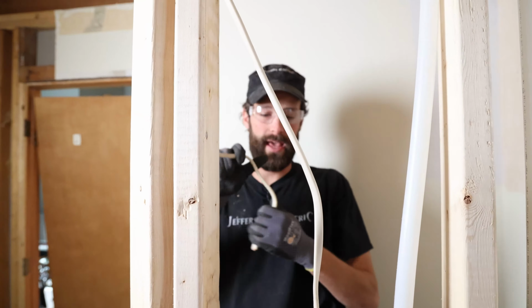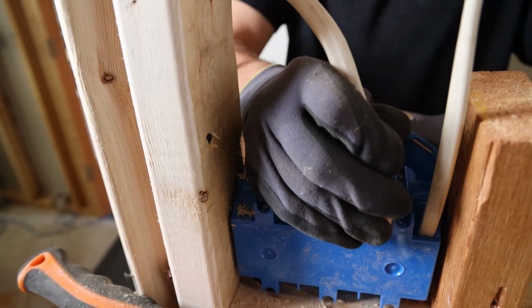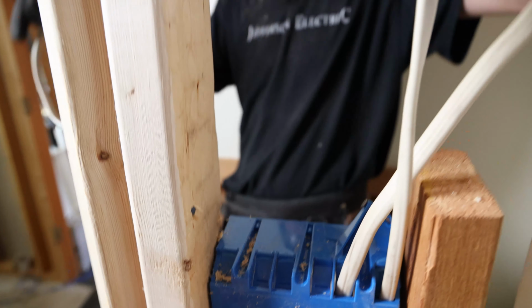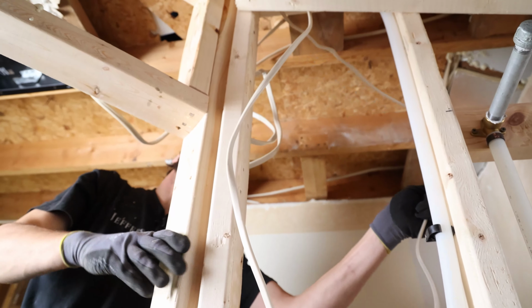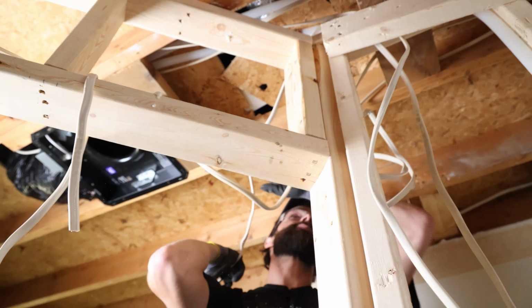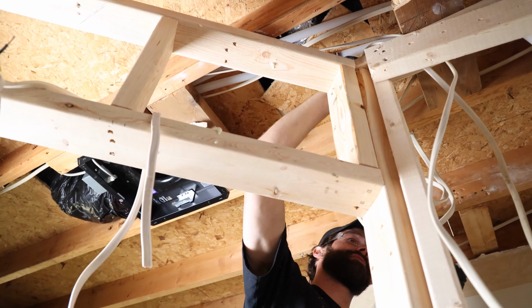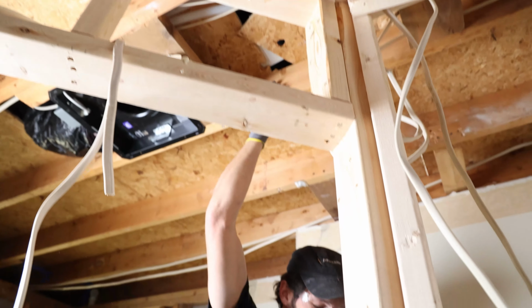So I'm plugging in at my slot for switch leg number 2. That's the middle position. That's toilet. I want 9 inches in the box, 1/4 inch of outer insulation in the box. Up and over we go. Through my drop ceiling space. It's not an acoustical drop ceiling, guys. Don't think that. It's not in a bathroom, not in a house. It's not that crazy. All right. So this is enough wire here to make it happen.